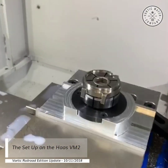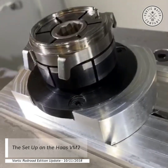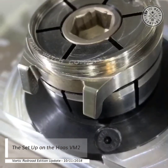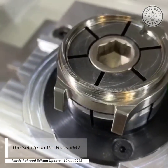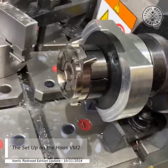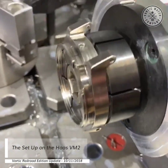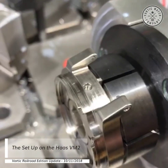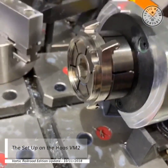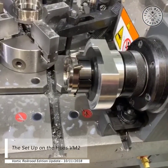After the first operation gets finished, we take that part and put it over here for operation number two. That's doing the top and threading the inside for the bezel. We're actually putting our signature — Vortix Watch Company — underneath the bezel. Then once that operation is done, it comes over here onto the fourth axis, where we put the holes in the lugs, the hole for the crown, and other operations to clean up the outside of the case. That creates one finished case part.